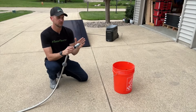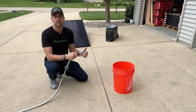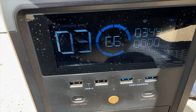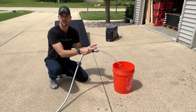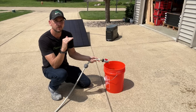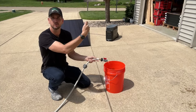Let's use a visual analogy to connect power and energy, because electricity can be a little confusing. Think of water flowing out of a hose and collecting in a bucket. The solar panel behind me — power would be similar to the flow rate coming out of the hose, let's say 345 watts, going into the EcoFlow battery behind me and filling it up just like the hose fills the bucket. If clouds come in, we're still getting flow but the panel might only produce 90 or 80 watts, so it takes much longer to fill the bucket, just as it takes longer to charge the battery.